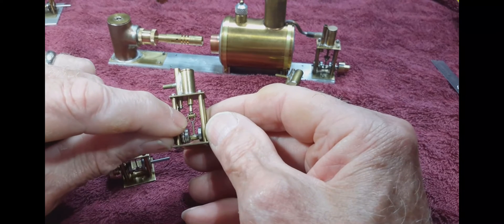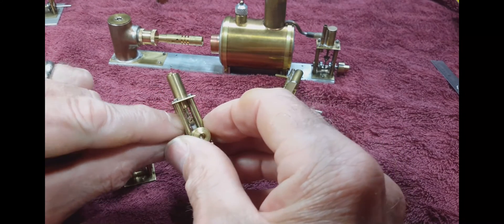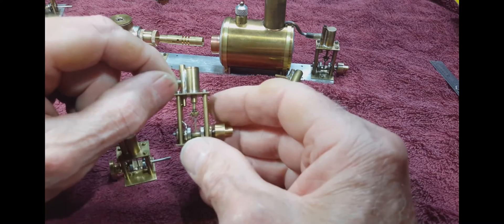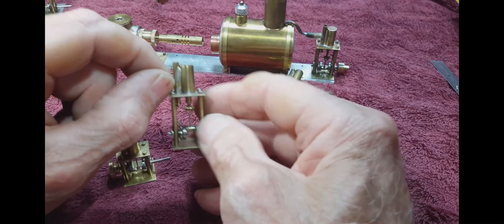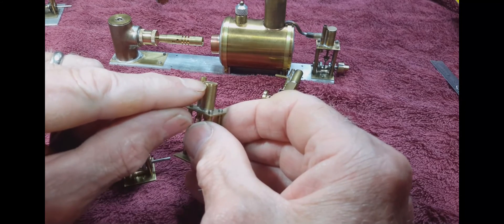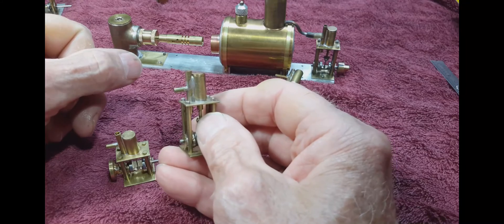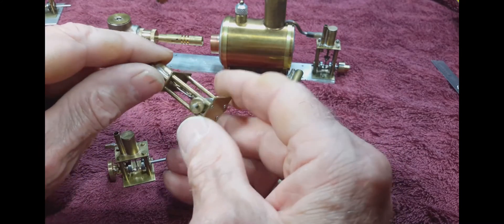There's a little tiny wrist pin in the top of the connecting rod right there that has little tiny pieces of copper ring that are squeezed into grooves on the pin, so that can be removed. And when that's removed, the piston can be removed up through the top. If you take the frame apart, you can get the crankshaft out and take the connecting rod off. The piston head is just a kind of a tight fit — the little cap is made and it's pushed in there finger tight — but the engines only run on about three to five psi of pressure, so there's not nearly enough pressure to pop that top off. The whole thing can be disassembled and cleaned if need be.